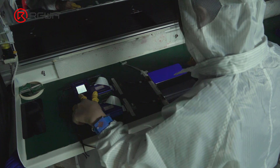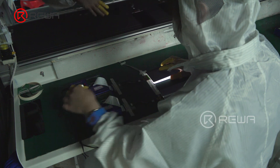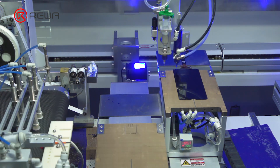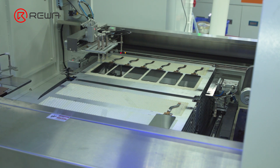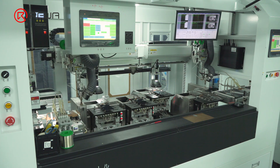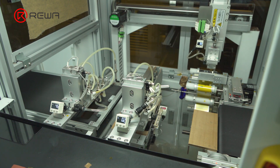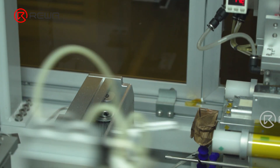After FOG, the workers perform a display and touch inspection, and the screen data is also written here. Next, the machine will protect the ITO area with blue adhesive and conductive silver pulp. After the automatic drying process, the backlight is assembled with the LCD. Soldering bonds the backlight with the LCD, and high-temperature insulating tape is applied to the flex cable to prevent problems like short circuits.